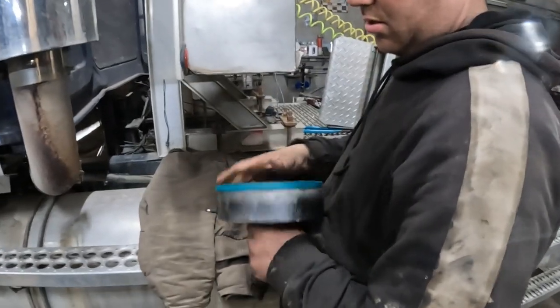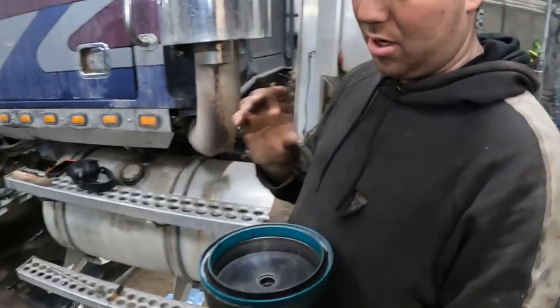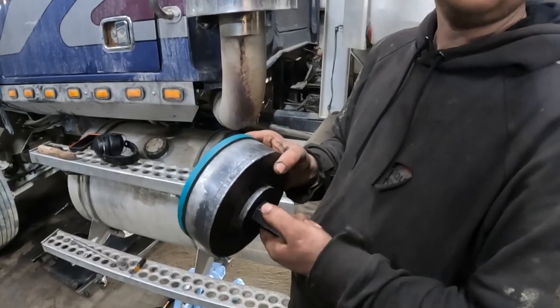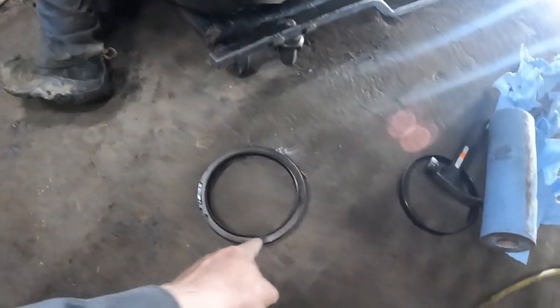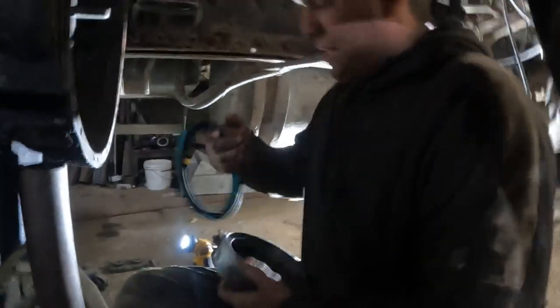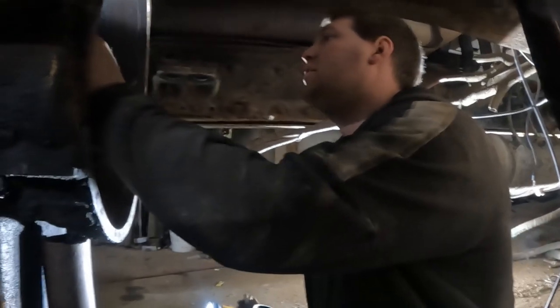All right, this is the push tool. I already put the other half on the crankshaft - it has three bolts on it, it lines up perfectly, and then you stick this on it and suck it in. This is definitely better than the punch. This is the old seal - it's really leaking. That's the kind of ring that was on the crank. We are borrowing this tool - it is not ours, but they were nice enough to let us use it.